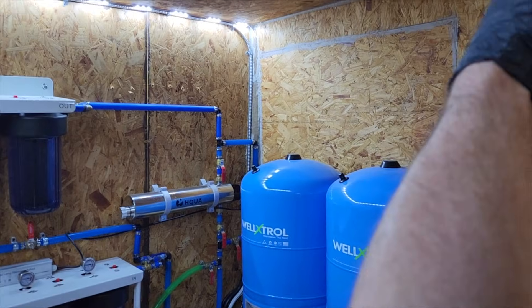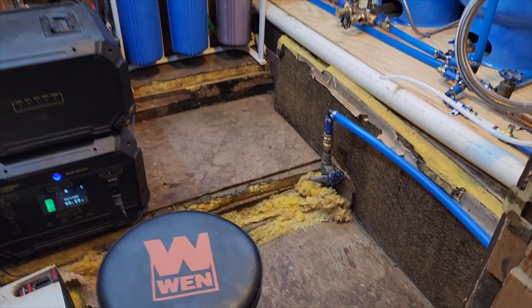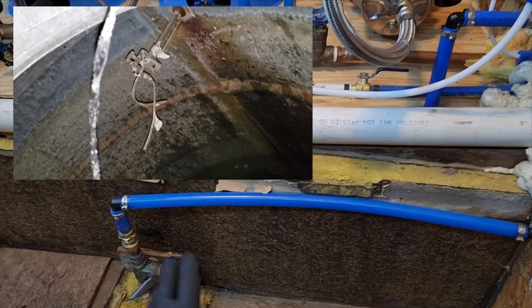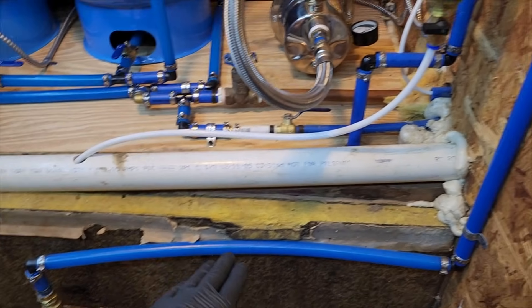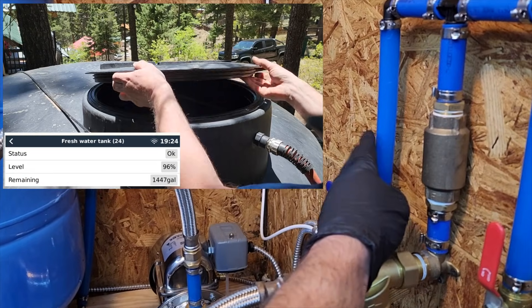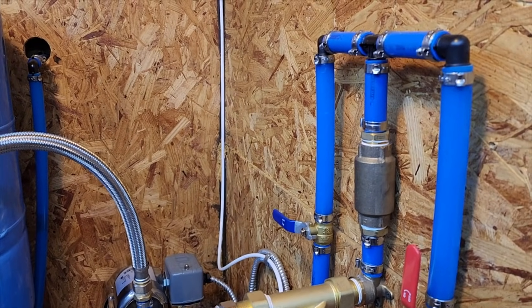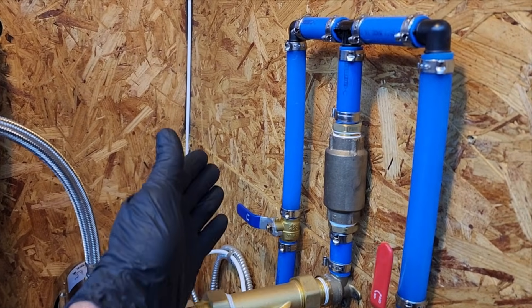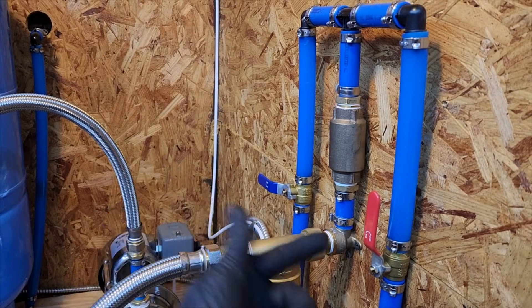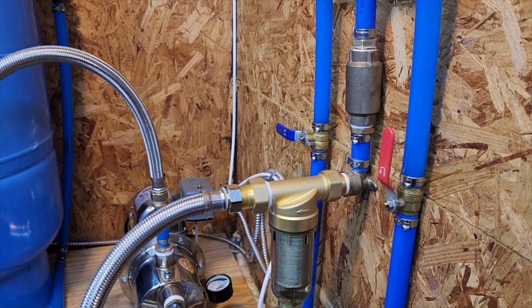It also has a normal light switch up top for that top light. This pipe here comes from my underground cistern, which is 3,000 gallons — it collects the rainwater and comes down through a check valve. The other side goes to our above-ground tank up above the house, which is a 1,500-gallon tank that we haul water from the city to fill when we need it. I have them separated because one is potable city water and the other is rainwater. With all the filters in place, we can drink either — no big deal.